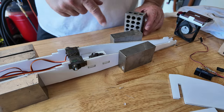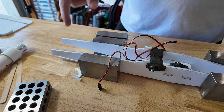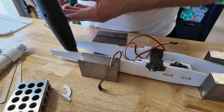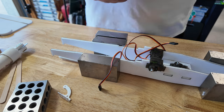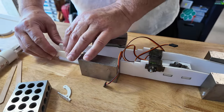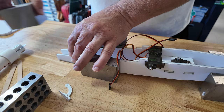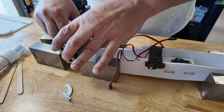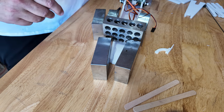I'm going to leave it in the jig. Pull the wiring back. Let's go towards the front end - lay some hot glue about an inch and a half, maybe two inches back. Now we've got to bring those front sides of the fuselage in and close that out. We can pinch them in like this, and you see how the airplane just rotates in the jig - that works out really well. Use these to squeeze it, move the center of gravity forward, and put the little fan in there.